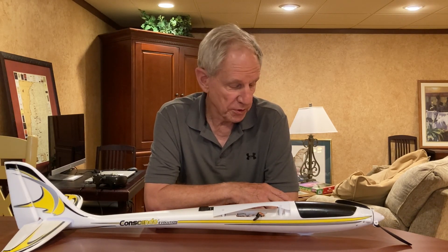Back in the studio — a lot cooler than that 90-degree weather out in the field today. One of the things I've run into is that the altitude will sometimes come up as mean sea level instead of AGL when you start it up, no matter what sequence you use — it seems to be random. The fix is to go to the telemetry page in the NX-8, look up GPS, go down to altitude, and toggle AGL/MSL back to AGL — that seems to reset the altitude to above ground level.